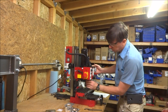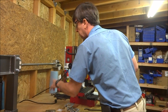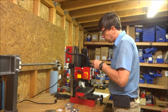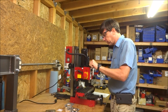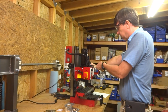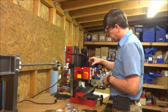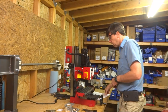Put this in here and rotate — oh! Not bad of me. Unplug the mill first. Safety first. It was already off, but okay. So I got that in there. Now we're going to take this in the clockwise direction. So we remove the spanner nut from the spindle — we take this nut out completely and put it off to the side.